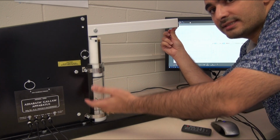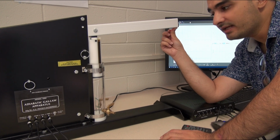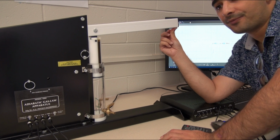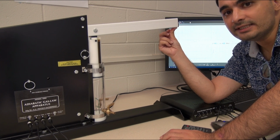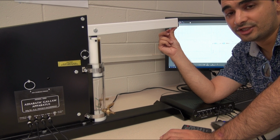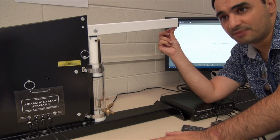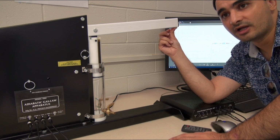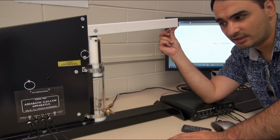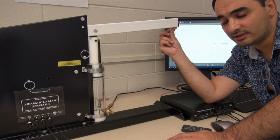So now air is trapped inside this cylinder. Because the isentropic exponent is going to be calculated using an adiabatic process, I need to have a very fast process to be adiabatic, which means Q, or heat transfer, should be 0. If the process is slow, temperature is going to be constant, and we call it an isothermal process. But for this case, it should be an adiabatic process, so I want to have a very fast process.